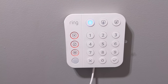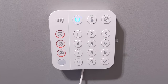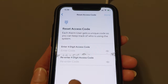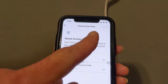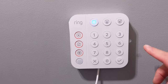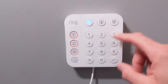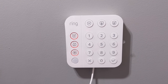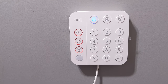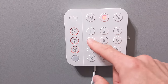The next thing you want to do is adjust all the system settings and set a four-digit password on your keypad. Go into system settings on the top left-hand corner, scroll down to usernames, click on your username, enter a four-digit passcode and re-enter it, then click done and save. Once saved, it'll be active on the keypad. Let's test it — we'll arm the system using 'arm away.' Exit delay started. And to disarm, we just enter the password and disarm. The same works for 'arm home' — armed at home, then disarmed.